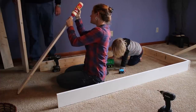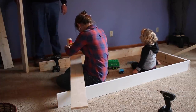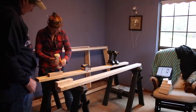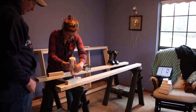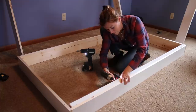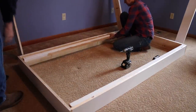Before setting the frame aside I glued and then screwed on the ledge that the slats will later rest on top of. Since this is an inside project I used Titebond Original for the majority of connections. Setting that aside so that we can build the two side assemblies — this was going to require multiple hands so I brought in some sawhorses to keep my folks up off the ground. We first attached some blocks that will act as ledges for the bed frames to rest on.